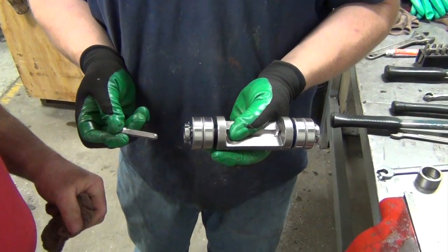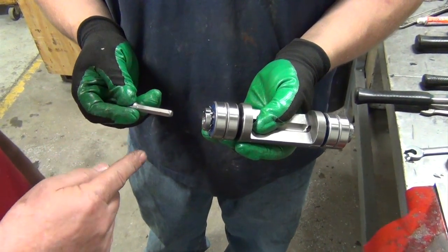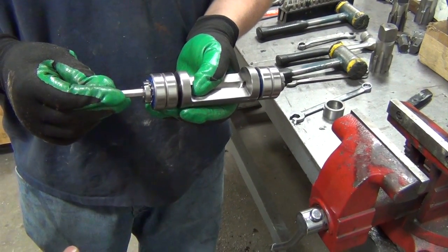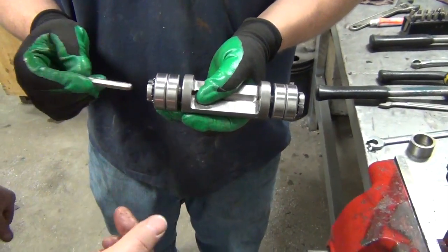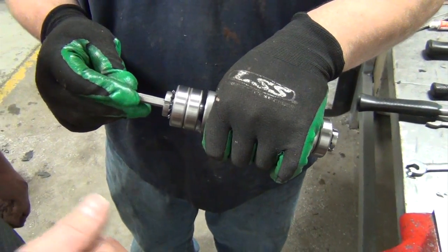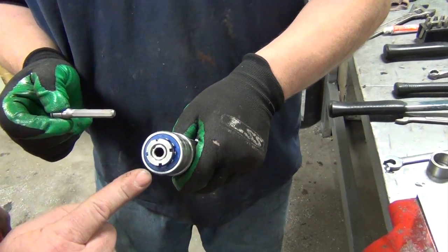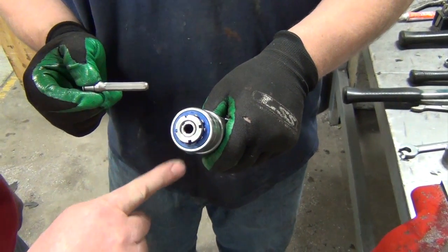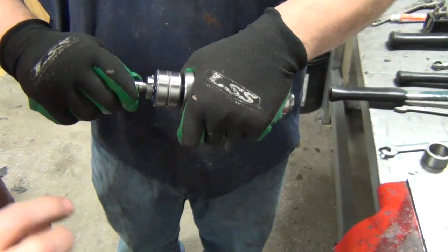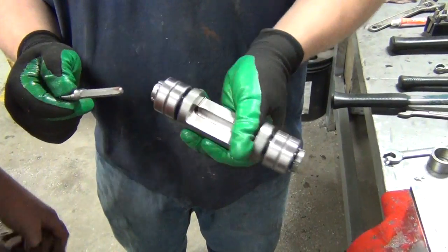We're getting ready to install the weight into the eccentric housing. We want to check the hexes in there. Take an old drive shaft and insert it into the hex about 3/4 inch and wiggle it back and forth. On these style weights, you want to check both ends to see which hex has the less play in it. The less play is the one you want to put on the drive shaft of the motor at that time. These weights are broached all the way down in, so if you insert the drive shaft all the way down in, you're going to get into good hex and you're not going to get a true feel for the worn hex part of the weight.